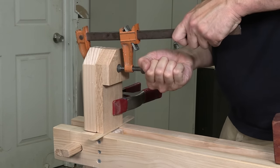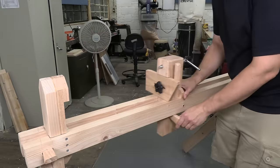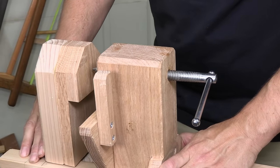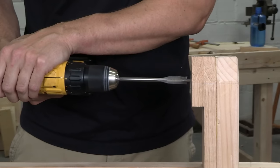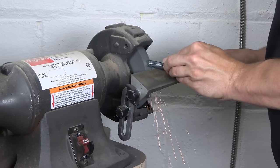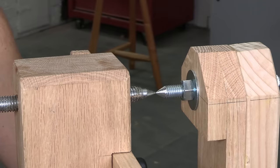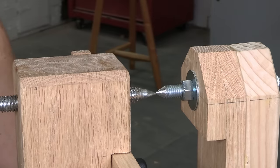I'm gluing on a couple of pieces of oak to make this part strong, and then I want my two centers to match perfectly. So I'll bring up my movable poppet and use the point to mark my center location on the fixed poppet. Then I can drill out my hole and install my fixed center. This is just a plain old bolt, and I ground the point just like I did with my other screw. I'm glad I took my time with this, because the two centers match up perfectly, and my work is going to spin true.